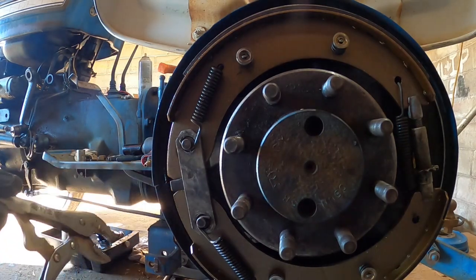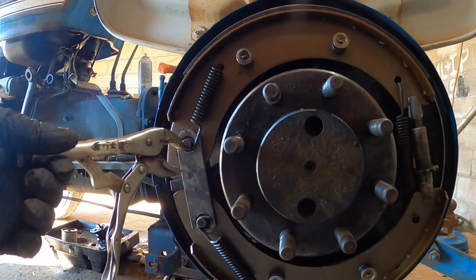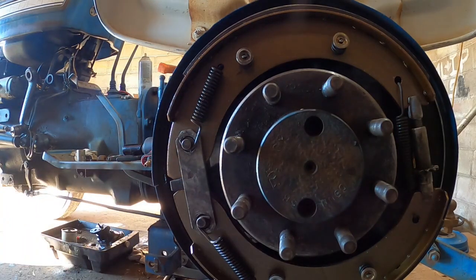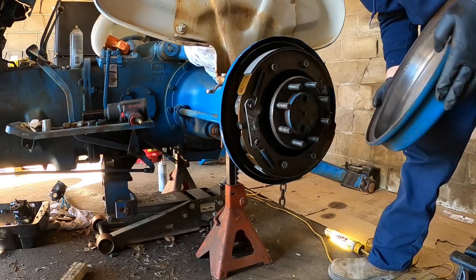On this upper one — I've got the spring started around there and it's biting on one point, but barely. So when I get ready to flip these vise grips off, that spring can very easily pop out. You want to kind of put something over this in case it does, or get a screwdriver and go ahead and pry the spring in there. It's kind of like a two-part motion. I already had this side right here caught in that groove, so when I popped them off I just kept pressure on that and it popped around behind it again. Not the proper method, not the safest way in the world. I do have my safety glasses on. That's it, guys — that's all it is to the brake shoes.